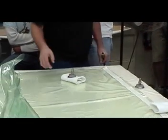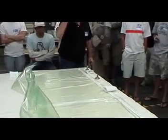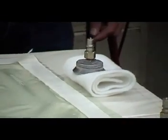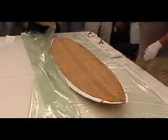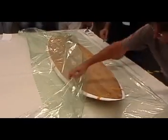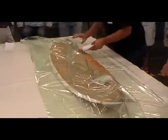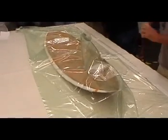We're going to kind of cheat a little bit here. Normally what you do on vacuuming is you give yourself some airways to pull vacuum. We're not going to get that fancy. They're going to slam this shut, and we're just going to put breathers over this. There's a variety of things to do. We're going to use quick disconnect vacuum probes. These are bayonet type.